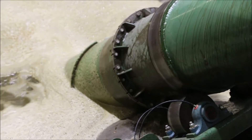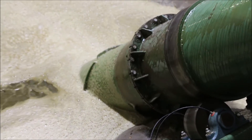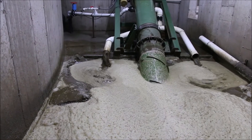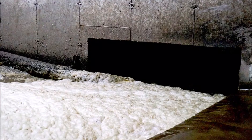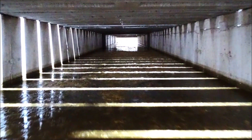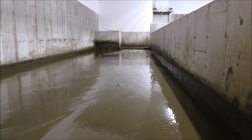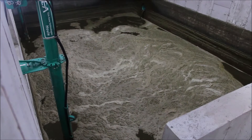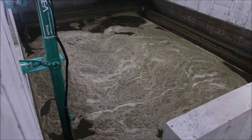In the one-shot, as the sand is lifted to the top, the water and manure filters down and exits at the bottom of the one-shot. The water and manure will continue through the cross auger. The cross auger will settle out any remaining sand and push it back to the one-shot. The water and manure will then flow into the mini sand lane, which will flow into the first reception pit closer to the DairyTech DT360.